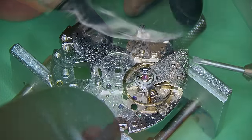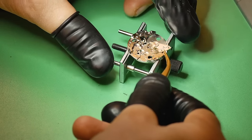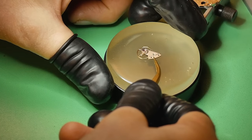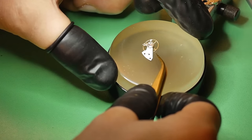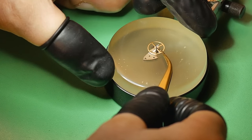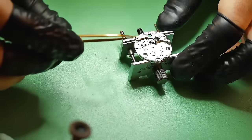I'm very happy with the results. Once you've finished, completely remove the balance from the movement and put it away nice and safe until you're going to need it at the end of the service. It goes back to what I said at the beginning — you've got to protect that hairspring. That hairspring is super delicate, super temperamental, and you need to really look after it.